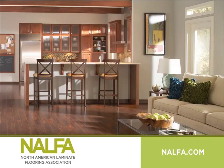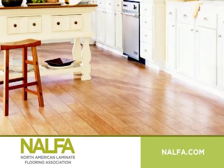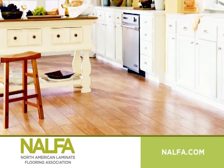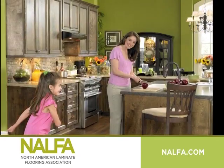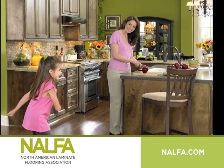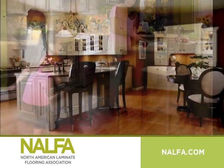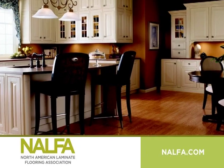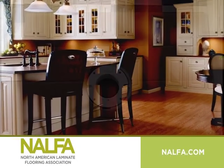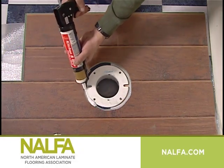Most laminate flooring is resistant to water and may be installed in kitchens, bathrooms, and laundry rooms. However, it is very important to prevent water or moisture from seeping under the flooring. In kitchens, bathrooms, and laundry rooms, fill all expansion and transition molding spaces subject to moisture or plumbing leaks — such as in front of sinks, toilets, dishwashers, and around the refrigerator — with moisture resistant 100% silicone sealant. Toilets must be removed and the perimeter of the flange and pipes sealed after installing laminate flooring.